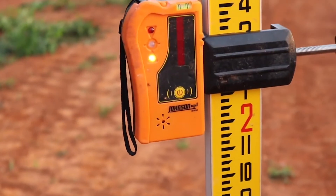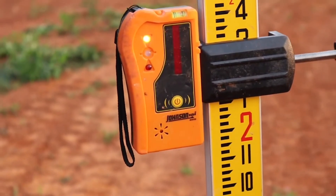In order to read that beam you need a laser eye receiver attached to a grade rod, because remember in bright daylight conditions you actually can't see a laser beam. Think about a laser pointer outside — you can't see it. Same concept, so here we use a laser eye receiver to see that beam.